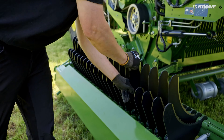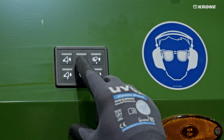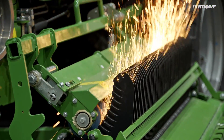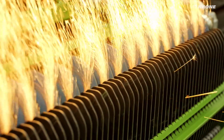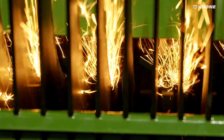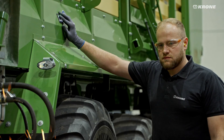The RX also features blade group switching. With the Krone Speed Sharp option, you can automatically sharpen 40 or 54 blades respectively in less than 5 minutes at a perfect angle and with constant contact pressure — a perfect sharpening process for ideal forage quality.